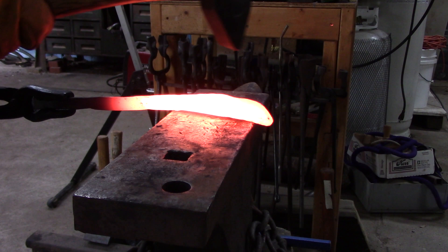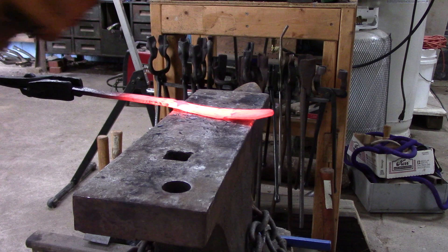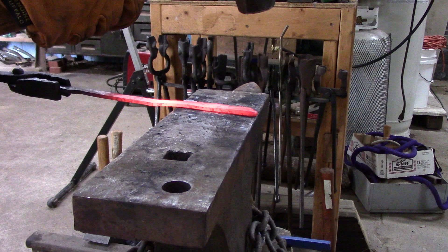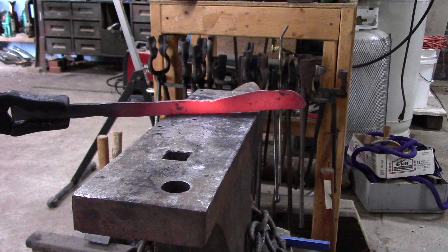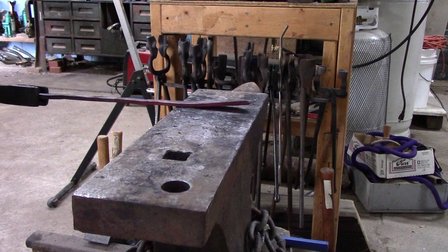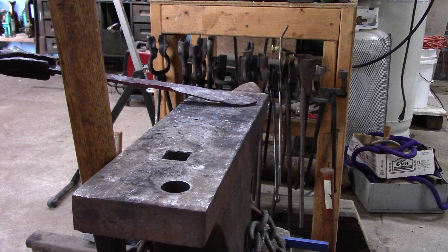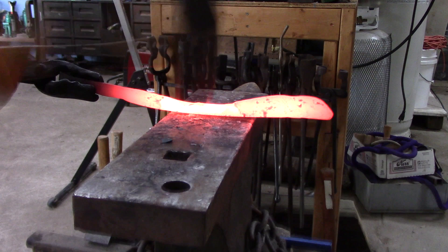At that time, since they didn't have epoxies, you had to fit a handle pretty much exactly and rivet it in place, which was much trickier with the tools blacksmiths had. Some of them did, but your average village blacksmith didn't take the time, so they made something a little simpler. I've got sort of a blade shape and I'm starting to draw out what will be the handle. The tang will be a long thin tang that's then curled back around and looped. I do roughly have some bevels forged in as well.